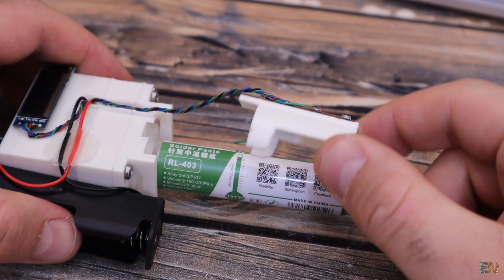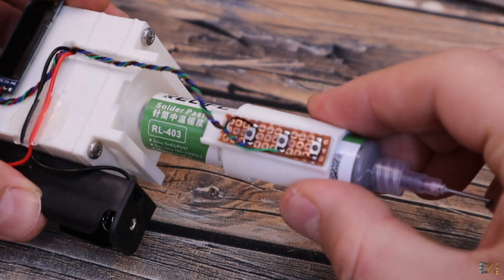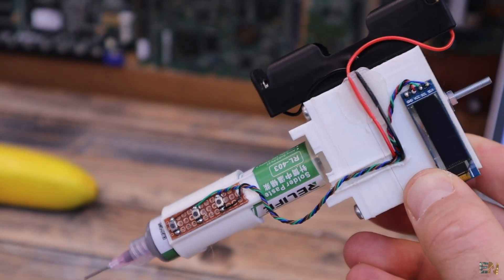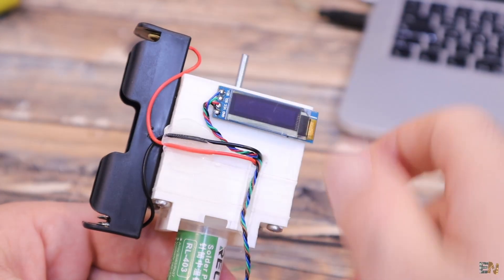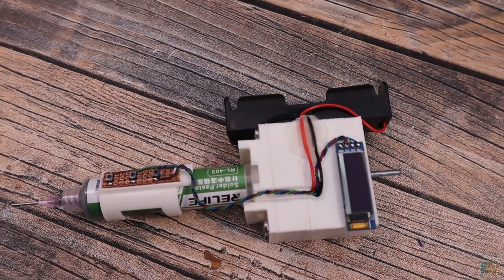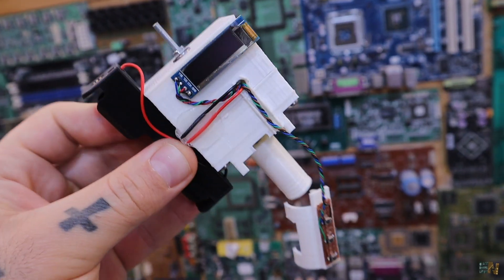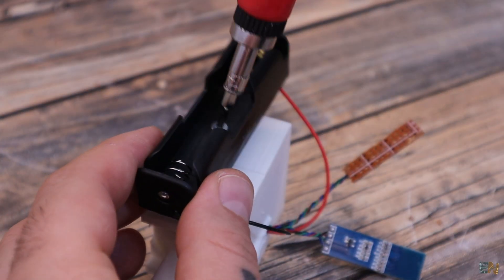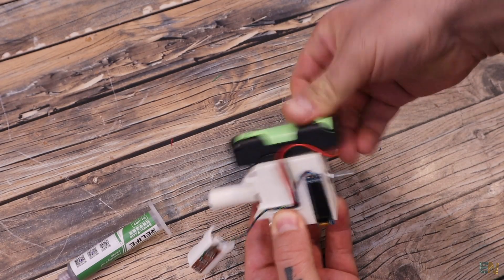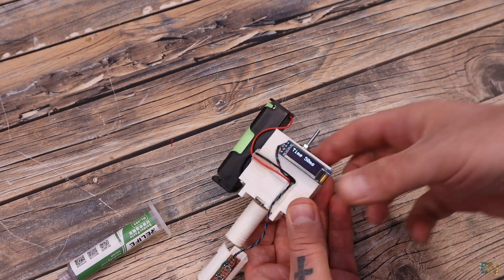Get the piston part and add another threaded insertion with the soldering iron. Now we can screw this onto the long screw — when it rotates, it will push the piston downwards and get the paste out. For the small buttons PCB, I've printed this ring clip and glued the buttons here so you can clip it in place over the plastic syringe. I've also glued the OLED screen on the side — I know it doesn't look that great, so maybe I will change the case design in the future. I also want to make a full PCB design for this project so everything would look better. The battery socket was screwed in place on the side with a small flat-tip M3 screw. The system is missing an on/off switch — for now, taking the battery out and putting it back in will serve as the on/off process.